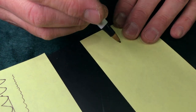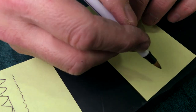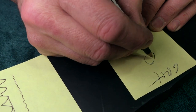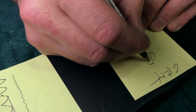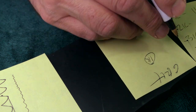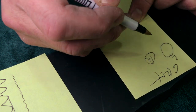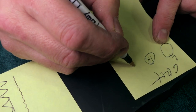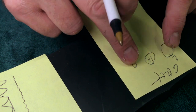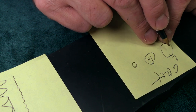It depends. So let's just say, grits have particles. You have a nominal. Let's say we're talking about 1K. According to the chart here, it's 11.5, so that's almost 12. But the whole stone isn't made out of that. You have larger particles, which can be quite significant, and this is by JIS standards. And then you have a bunch that are smaller. There are going to be more smaller than larger, and there's an allowable percentage of both. However, these large bastards are there and they can wreck your day.